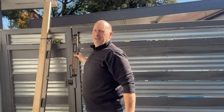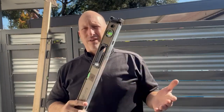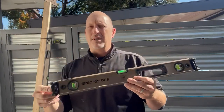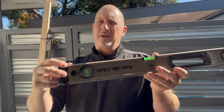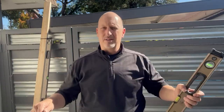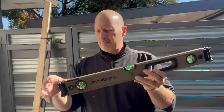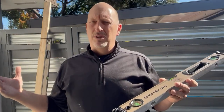These will be great for general construction of any sort. However, I do a lot of concrete and tile and grout, and I would not use these for grout leveling or concrete work, because inevitably this thing will get filled up with concrete. We all try to keep our levels clean, but you're tiling, you get thin set drying on there, you get a little concrete splatter and they get cleaned up later. That's why it's important to have a sealed bubble area, and for that purpose I would prefer a solid level like I'm used to using.